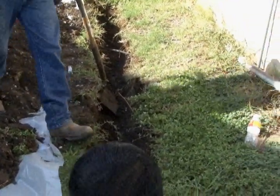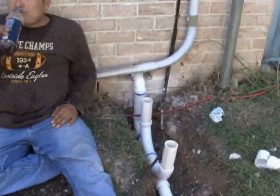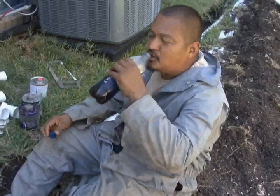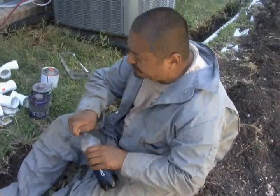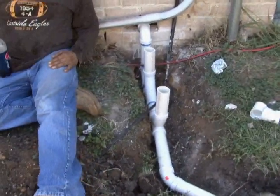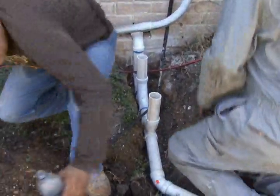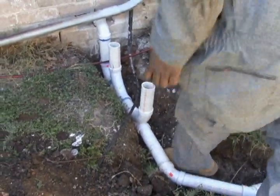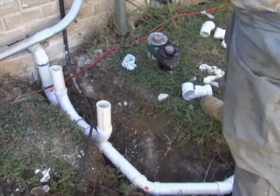This is the kitchen sink. What we've done is come out of the wall there. This is our crew foreman taking a break with a cold Pepsi — not sure why Pepsi, but you know, some people. What this is, basically, are clean-outs — double clean-outs — so that you can send a sewer machine down either way, towards the house or towards the main sewer line.